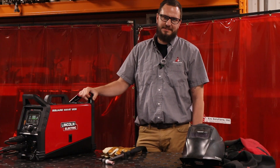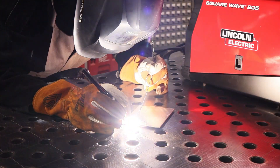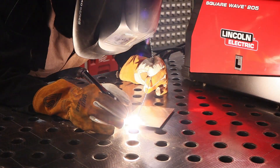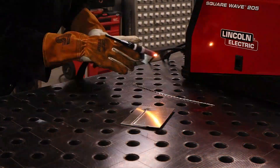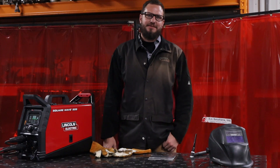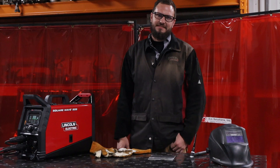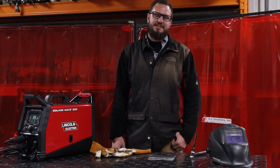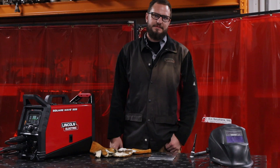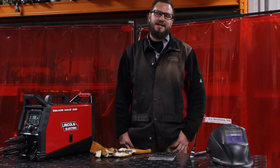We're going to start with welding with TIG, aluminum. As you can see from the close-up, it welds really nice. I like the pulsating feature — it allows enough time for the puddle to cool to prevent burn-through. This is a good function for beginner welders to use.